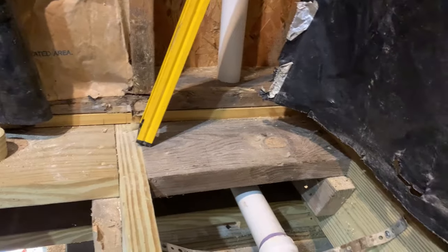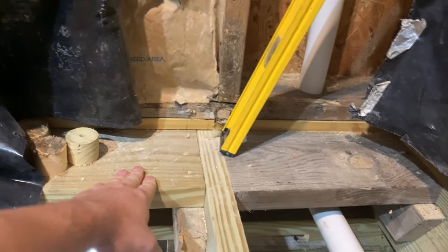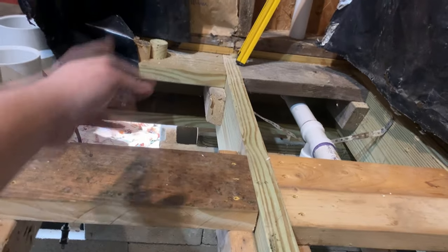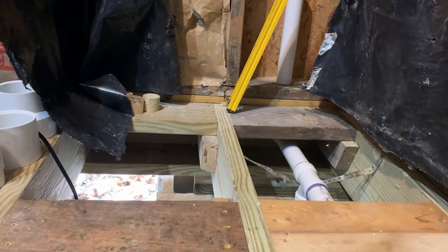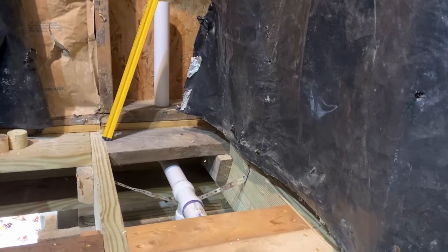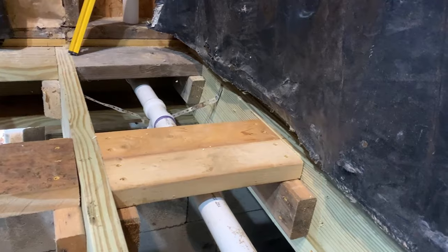Right up against the wall — because the floor used to sit on the OSB that was here before — we jacked up the wall and put in treated lumber underneath the wall itself. That's a three-quarter inch piece of treated lumber under the wall plate. Then we've got our blocking for the OSB, and this blocking back here is actually to hold the edges of a wall that'll go about right here when it's all said and done, in order to conceal a fan and a utility cabinet for towels.